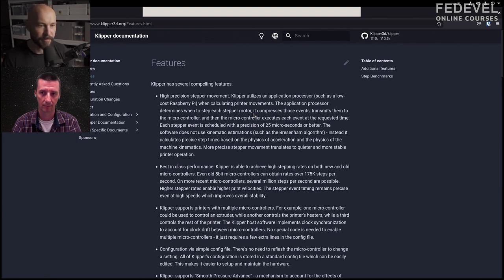So there's some kind of protocol between the microcontroller and the board that prepares all the data. Klipper is distributed — it runs on both the single-board computer and on the microcontroller. It has two parts with a protocol between them, which is not G-code but a lower-level protocol with more finished calculations.